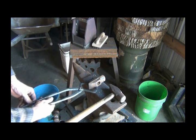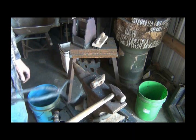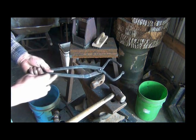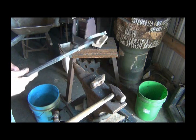Let's grab a hammer and see. I went and found an old hammer - this is how they're used. You can grab them and just flip your stuff around, roll it over when you're forging different areas on the hammer. You see the pros using these type of things all the time and they're real quick with it on their power hammers and stuff. I've got small ones and longer ones, and we'll see if I can make those into some hammer tongs for some big sledgehammers or something. There they are - all I did was round these edges off so it wasn't such a sharp corner. I'm going to tighten that rivet up a little bit and then I'll call it done.